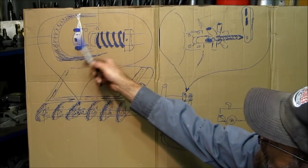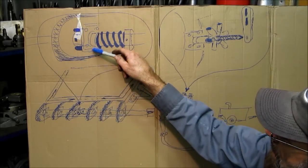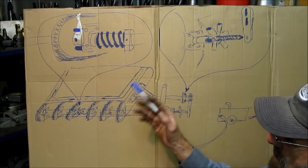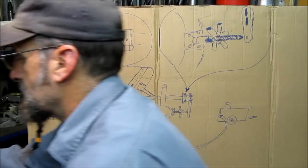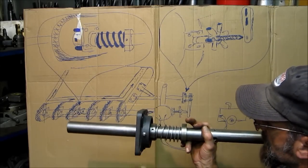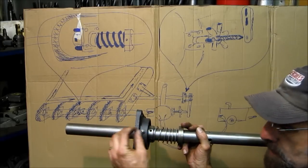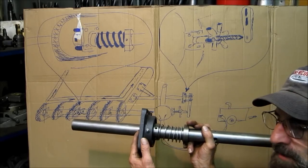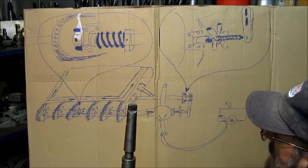Here's an enlargement of that drawing. Here's the ear, your bearings mounted, with straight solid standoffs that held this bearing instead of a ring, because we were locating this bore in relationship to the flat face — distance out, distance down. That same correspondence was done on the mating hinge points on the ship itself. Here's a close-up: the collar would be set-screwed on, and that's how you preload the bar. My travel for those ears on that job was about two inches, give or take a quarter inch, so an eight or nine inch spring would be sufficient to control the travel. The star drive had the same thing, and on the end of the bar was a Morse taper that fit and locked into the air motor.